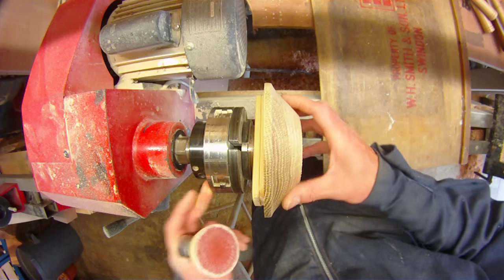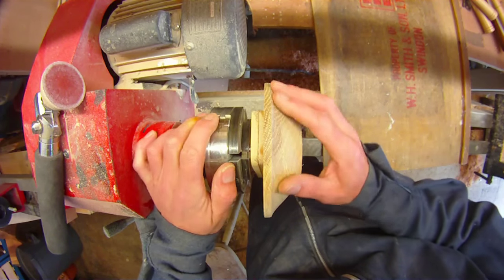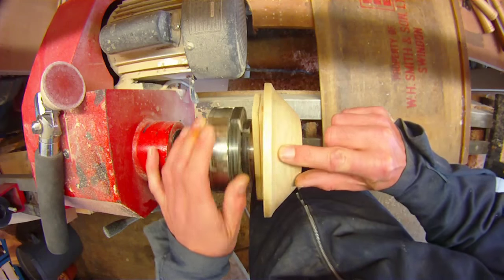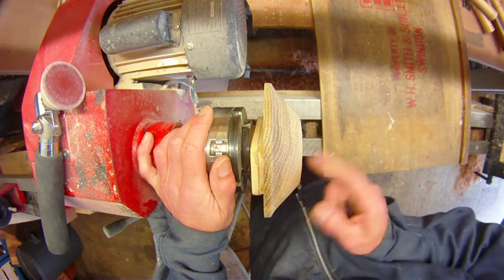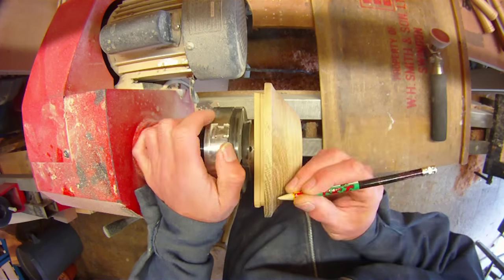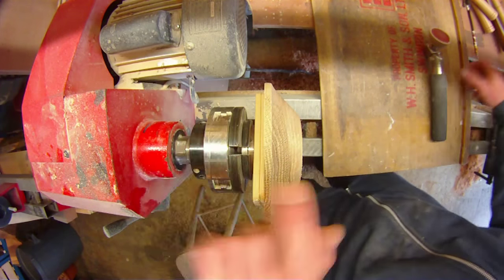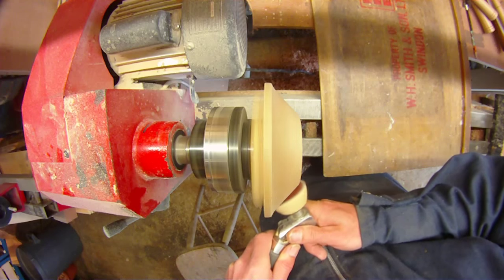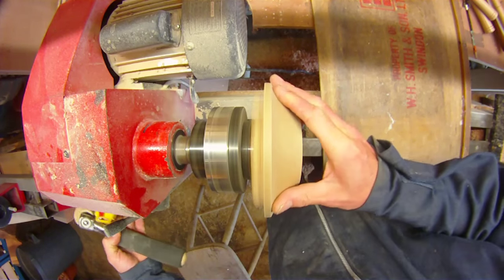When you think you've done enough, stop the lathe and go over the piece carefully, looking in all the grain areas for any remaining tool marks or any fluffies. I've got a tool mark here that hasn't come out just yet, so I need to keep going before I start doing the bottom. One thing you can do is put a pencil mark where those lines are that you need to sand down to — they will serve as a reference. When you're spinning the wood, you keep sanding until those pencil marks disappear, and then you know that those tool marks have gone.